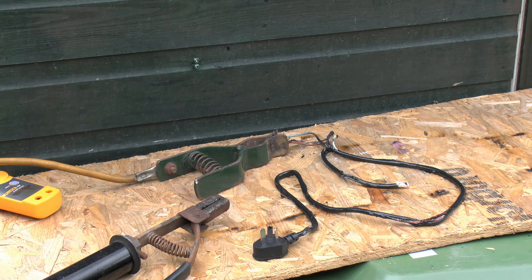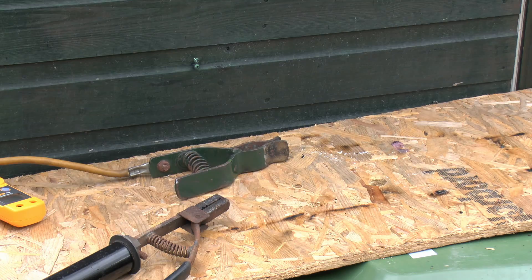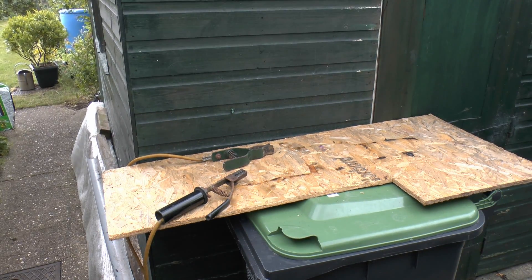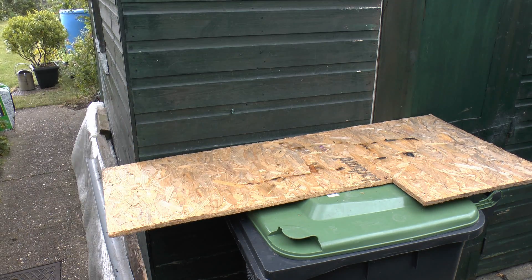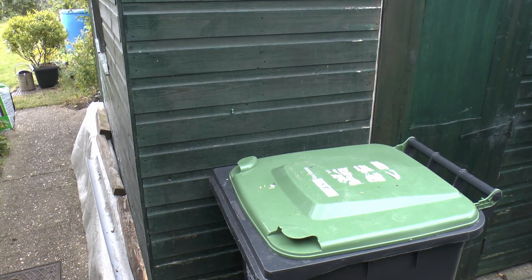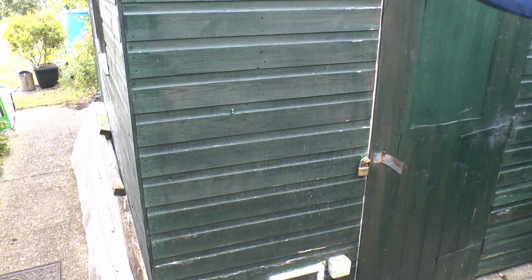So although it wasn't actually copper inside, it would have done the job with a 1 amp or 2 amp fuse in that solder pot. But of course that plug is no good for the UK anyway and would have to be replaced with a UK one. The wire of that style is really difficult to twist together, so it's pretty obviously not copper - it's obviously some sort of aluminium or other non-copper metal. So there was no real point to this other than to destroy the piece of flex. Thanks for watching.